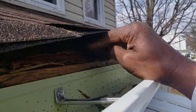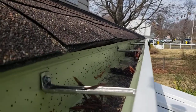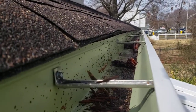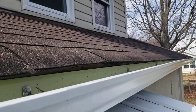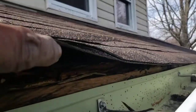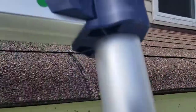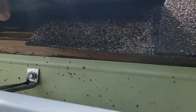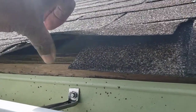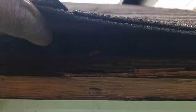This very often happens when your gutters get full of debris and don't drain properly. In wintertime, snow and ice builds up in there and then builds up under the shingles. The edge of the roof — called the sheathing — then starts to absorb that water, and then slowly over time it rots out. That's what you've got here; you can see all of this is wood rot.